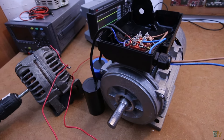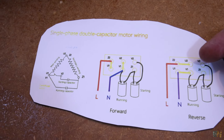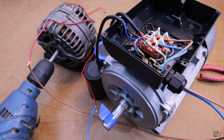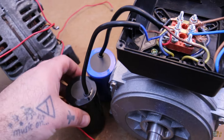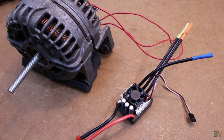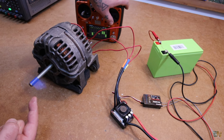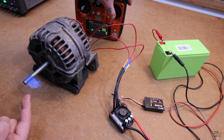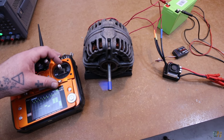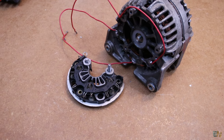The power output is quite high even though the voltage is below 20V. Knowing we have peaks of 200W for each phase is enough for me. Now let's see if I can rotate the induction motor — this is a one phase motor, the same as they use in the fake free energy video, so I only connect one phase from our generator. I connect the generator to the motor and start generating power with my drill. As you can see, it doesn't have the power to even start up the motor, because induction motors need high voltage to jump start rotation. That's another indication that the free energy video is fake.